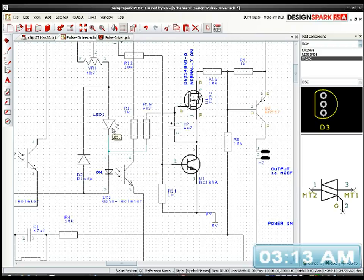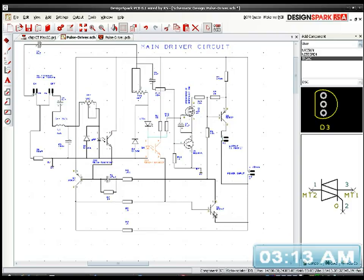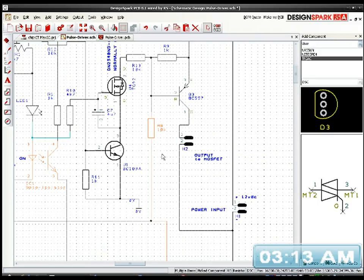So, right, our opto isolator is active. And because our opto isolator is active, it will turn on our latching circuit down here. So the latching circuit will be turned on. That will send a signal up through these lines here to this 10K resistor, and that will also turn on the Q3, which was previously being turned on by our BC109, which is no longer active because it's been turned off. So that, in theory, is what should happen.